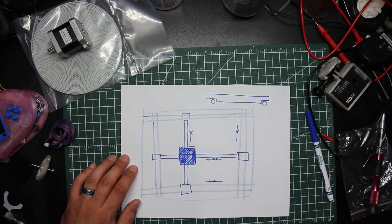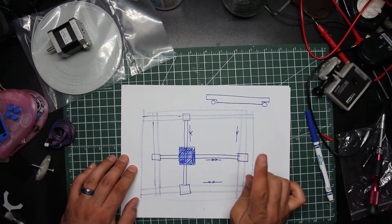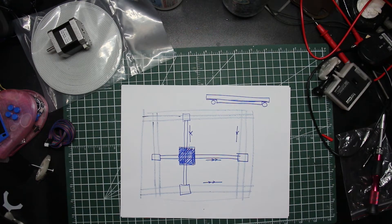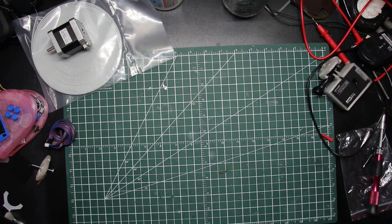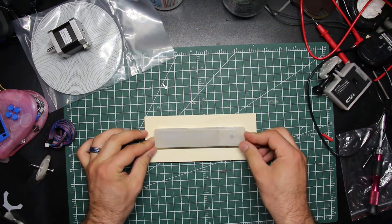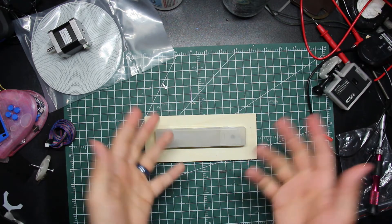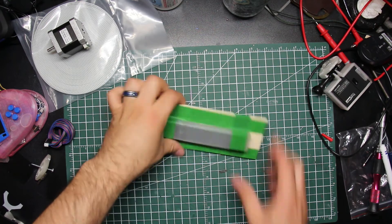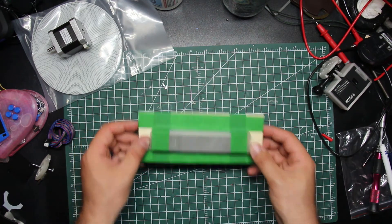A simpler way is to take a piece of something that can sit across both rods with a consistent distance in the middle — something shaped to sit on this rod and this rod and cinch them together all the way along. There are 3D models you can print for this, but my printer isn't calibrated enough right now to do that. I need to get creative. After a few seconds of rummaging I found this little piece of board and this pack of X-Acto blades. I think this will probably do it — why get fancy with it?